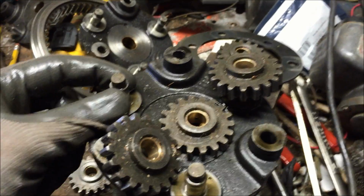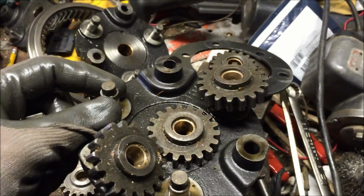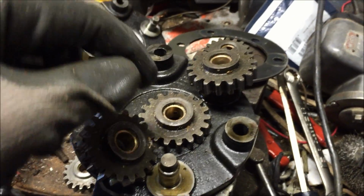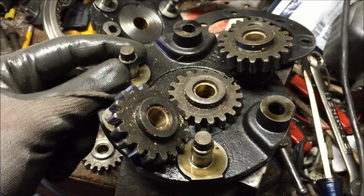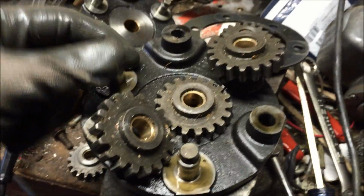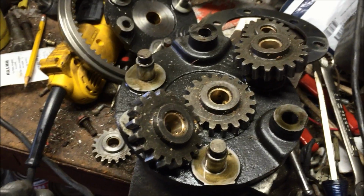It's not too scientific, I just do it by feel. I'm not measuring anything when I'm reaming. It's very sensitive, so I take a little bit off, I'll ream it once, I'll test it, I'll do all 3 to save setup time. I'll run the reamer through again with a hair bigger setting, try it again, it doesn't work, then we'll just keep redoing them. And I found that that's the fastest way to handle it, with the least setup time.